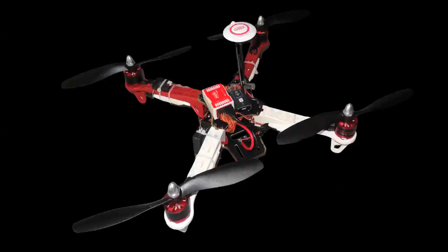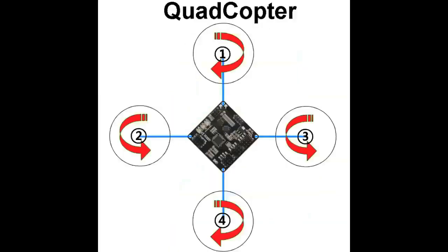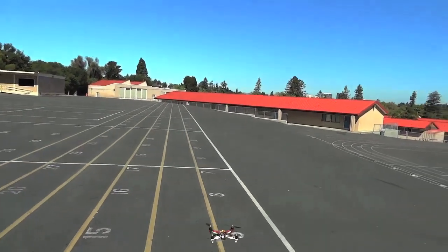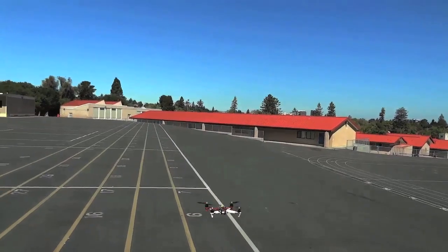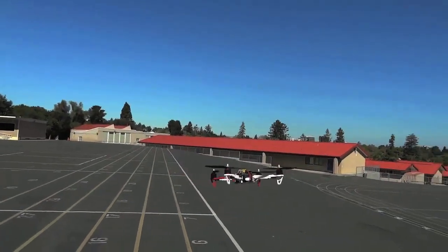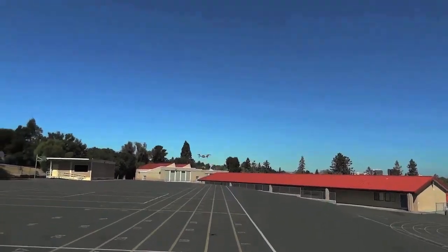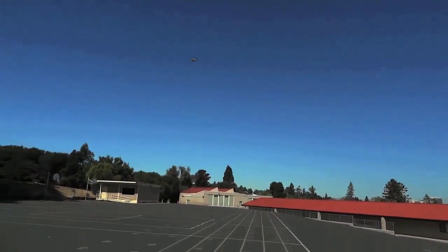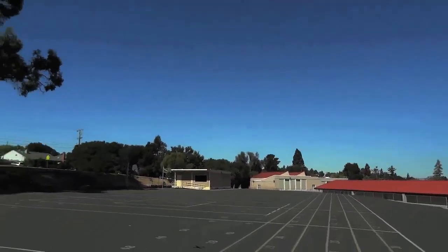So let's step into the quadcopters. Typical configurations for quadcopters is going to be a 4 motor in an X configuration or a plus configuration. They fly basically exactly the same, it's just how they're programmed. Now pros, it's simple, it's elegant, it's generally fairly powerful because you have 4 motors instead of 3. And they're pretty forgiving as far as setup goes because you have no servo motion, you don't have anything to play with in your flight control board. So pretty forgiving. It's probably the best setup to start with.